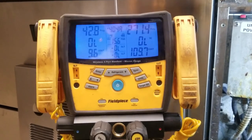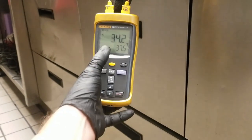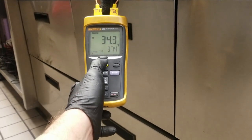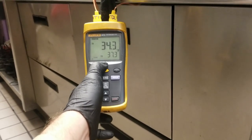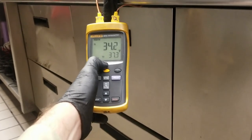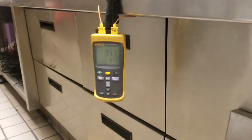We're going to wait for it to satisfy and pump down. I don't like this — I don't know if it's just a fluke or a problem. The 34 degrees is the left coil and 37 degrees is the right coil — that's return air. They should be pretty much identical. So I'm going to have to make sure both coils are actually working properly and that we don't have a bad TXV on one of them. Looks like we've got a multiple issue here.